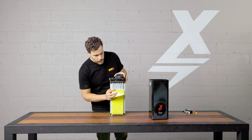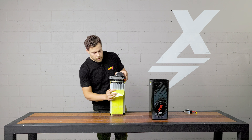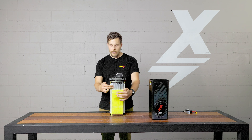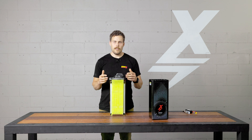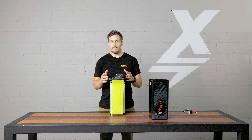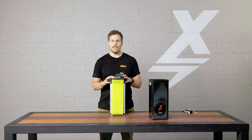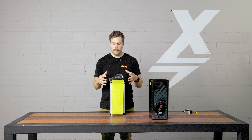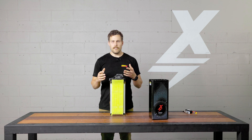These cells in this battery are 57 amp hours each. You can see them all in line here, and there are some more on the side. The construction of this battery is 1 parallel and 20 in series, which gives you 72 volts. These cells have a continuous discharge rating of 6C. We switched a while ago from LG to SKI cells because they had better performance and fit the form factor we're looking for.